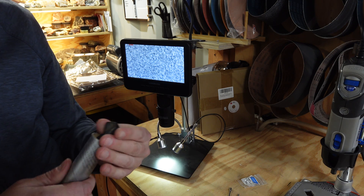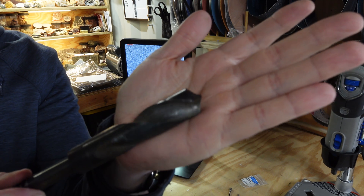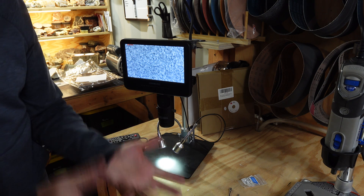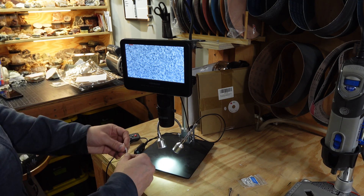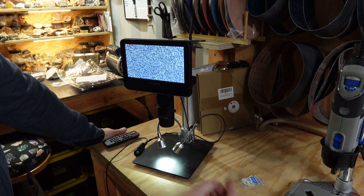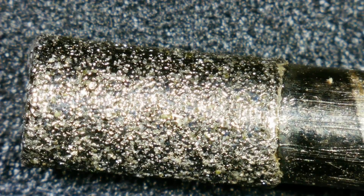Typically when we're talking about drilling a hole in something like wood or metal, you might be familiar with something like this — just a split point drill. We have two sharp edges here that really slice the material away, as opposed to working with stone, where we grind things away. Here is some aluminum that I drilled and produced a shaving — that's just a long curly sliced piece of metal that a drill bit produced. We're going to be using our little diamond burr here for one test.